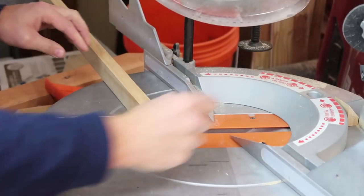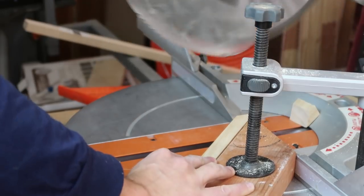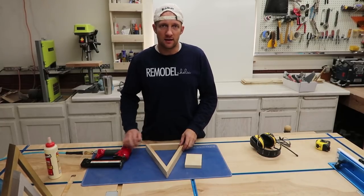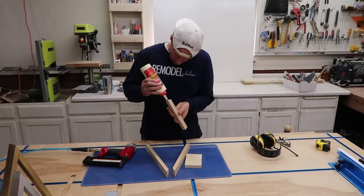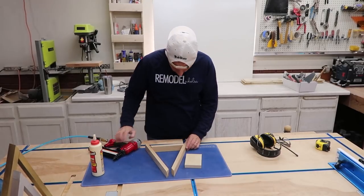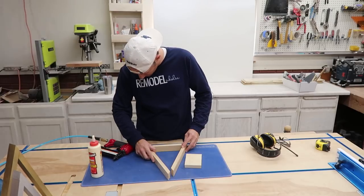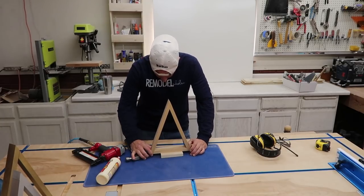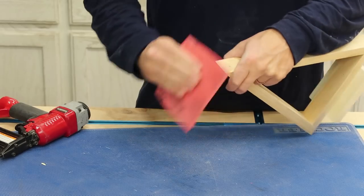We're gonna cut this end first at 20 — I'll rough cut it. So this is how it turns out. All I'm gonna do is put a little glue right here in between these joints and nail it together with the brad nail gun. I don't want too much glue so it oozes out the sides, just enough to hold this together — the brad nail gun acts as a little clamp. You don't have to use a brad nail gun; you can just glue it, clamp it, and let it sit. I'm gonna let that dry, then sand the edges — just a quick little sand job — and then we'll paint it.